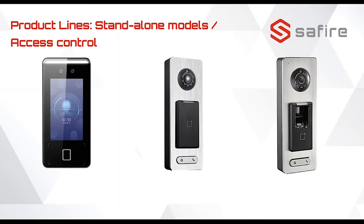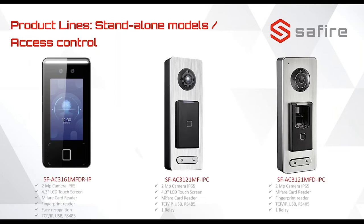There are another three standalone models for intercom and access control. The first one is with face recognition — in the database you can record faces for fast access. It is very reliable; even a picture won't work because this unit has two cameras so it recognizes faces in 3D. You can also use the fingerprint reader and card reader. The second is more robust with card reader and call button, and the last one has fingerprint reader and card reader.